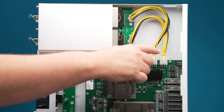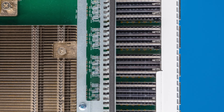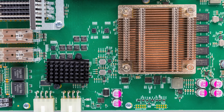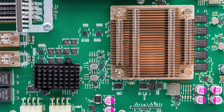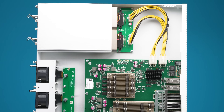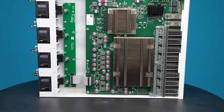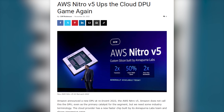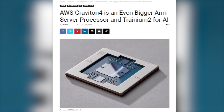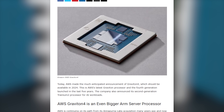The main switchboard has not only the main switch chip, but also the optical cages and management processor. This is the same ARM processor used in some of MikroTik's CCR cloud router lines. Annapurna Labs was acquired years ago by AWS, and that team is now also in charge of chips for AWS Nitro and the Graviton line — so this is kind of a way to get an AWS chip into your MikroTik router or switch.